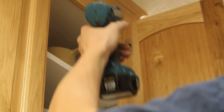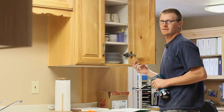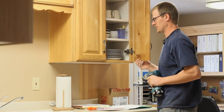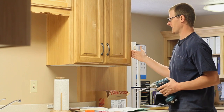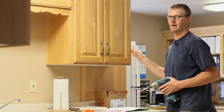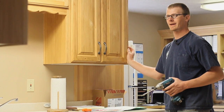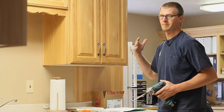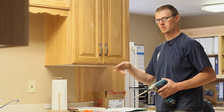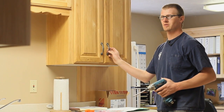If for whatever reason tightening is not working, what I would suggest is getting a screw that is just a little bit longer. The screws I put in there to hold this door on are just three-quarter inch screws. I'd probably put like an inch and a quarter screw in through that spot — that's going to make it so the area that was stripped out is going to be able to hold stronger.